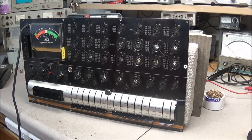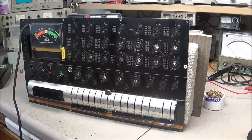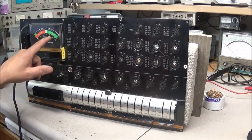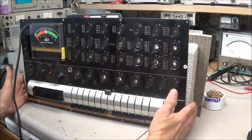Here on the bench today we have a B&K Precision model 747B tube tester. This is a solid state dynamic mutual conductance tube tester. The customer bought it from eBay and when he got it home it did not work correctly. He opened it up, called me, and said there were two bulbs in the back and one was out. He ordered some new M57 bulbs — there are two in the circuit that balance out the grid circuit.